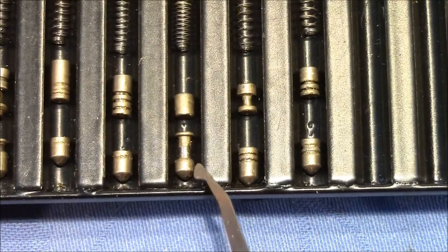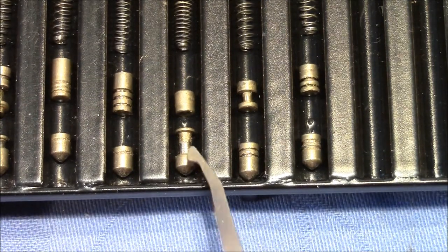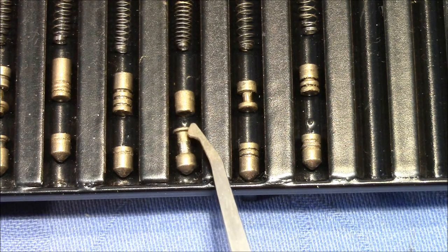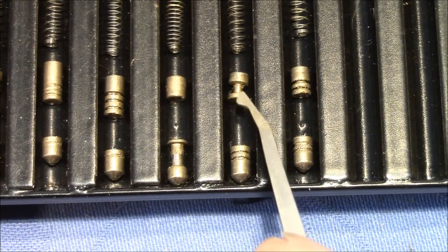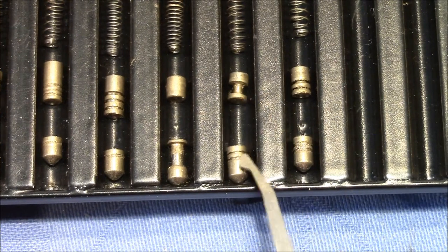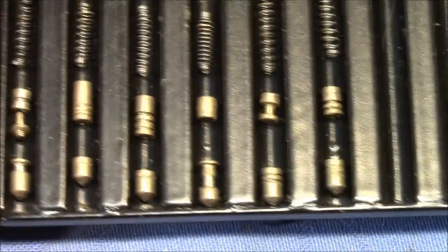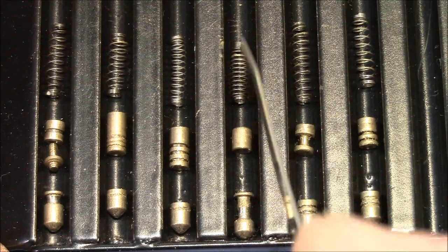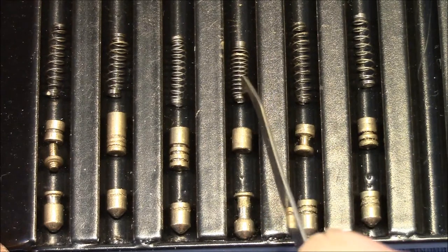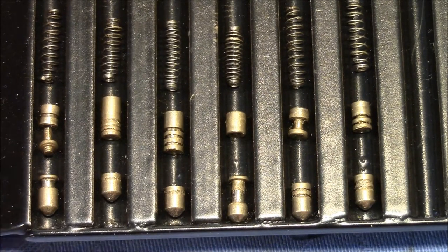And here we have the overset trap that I got caught in multiple times, I believe, in four, with a very sharp edge here and a standard driver. Then a spool in five with a serrated key pin, and a serrated key pin and driver in six. We have a weaker spring in four, which fits perfectly to the overset trap.